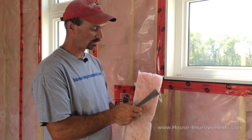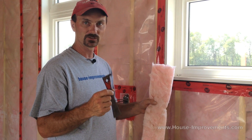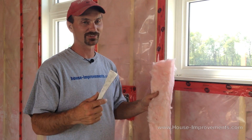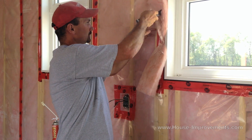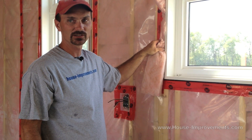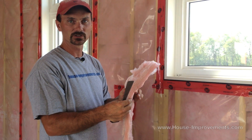You really need the insulation and some kind of flat utensil to help slide and guide it back in there. I like to use a flat pry bar — I use a pry bar for a lot of things in my videos. You could use a butter knife, a ruler, whatever fits back in that opening. What you don't want to do is just ram in as much as you can and think it's full. That's the worst thing you can do because this type of insulation, once you get it too compressed, you actually lose your insulating value.